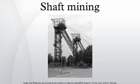In North and South America, smaller shafts are designed to be rectangular with timber supports. Larger shafts are round and are concrete lined. Final choice of shaft lining is dependent on the geology of the rock which the shaft passes through. Some shafts require several liner sections; where shafts are sunk in very competent rock, there may be no requirement for lining at all, or just the installation of welded mesh and rock bolts. The material of choice for shaft lining is mass concrete, which is poured behind shaft forms in lifts of 6 m as the shaft advances.